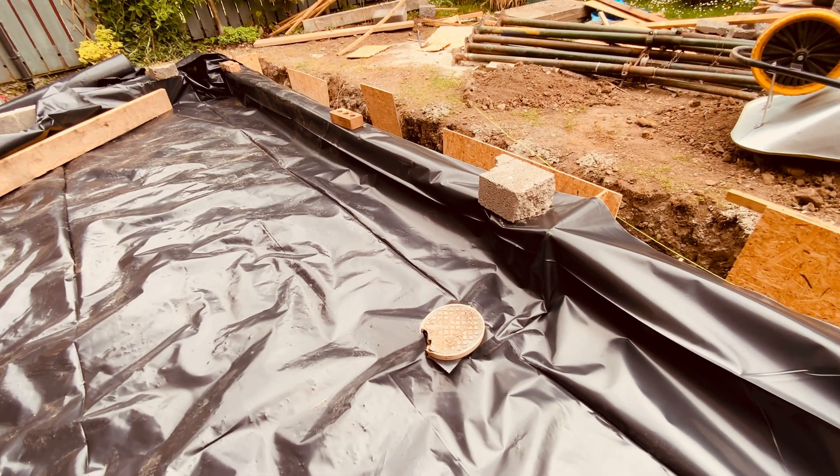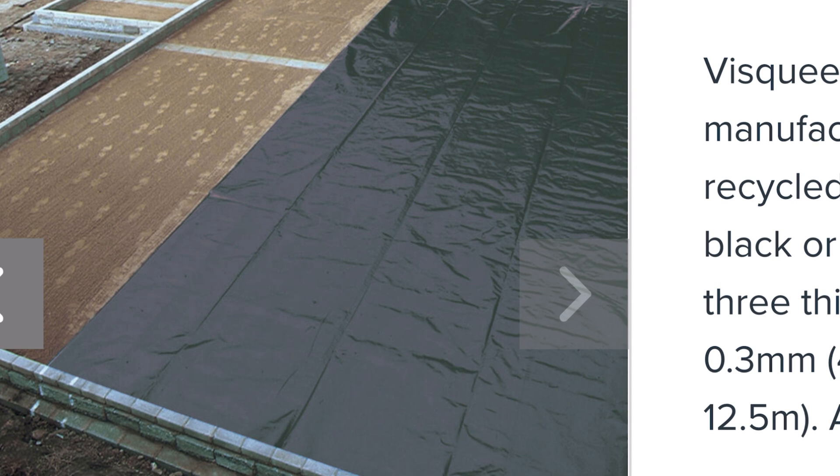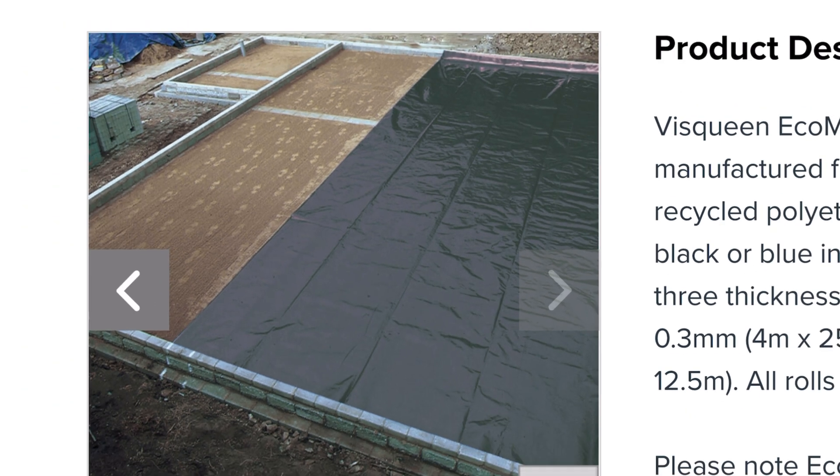Now for some tips to help us sound like experts. Tip one for the DPM: make sure to wrap the membrane up around its edges to create a kind of skirting, which increases effectiveness and avoids moisture transfer around the edges. It's always the edges and junctions that people get wrong when thinking about damp control and cold bridging. Tip two: lay the DPM on a smooth compacted base. If you've put down hardcore to level the site, sprinkle a layer of sand — called blinding sand — to about 50mm deep. This protects the DPM from punctures against any sharp edges of the hardcore.